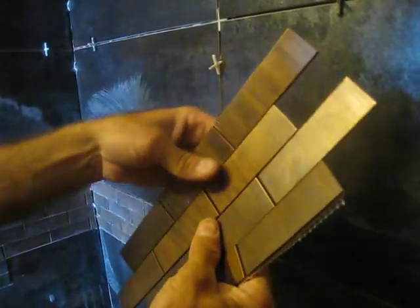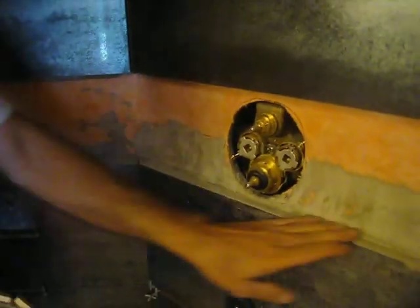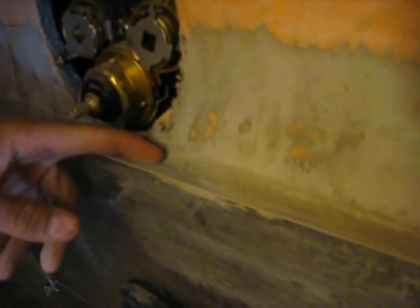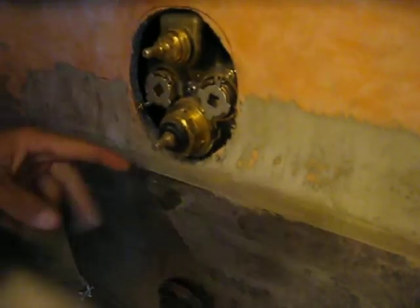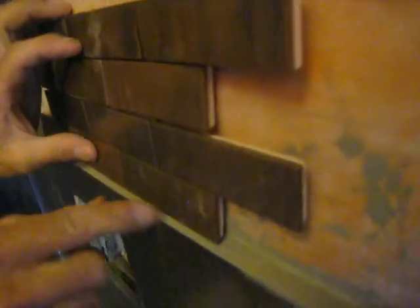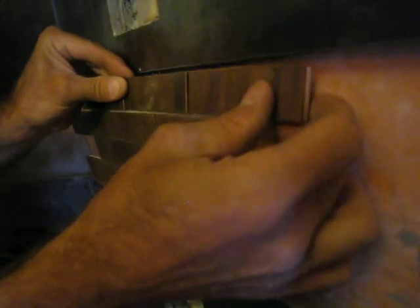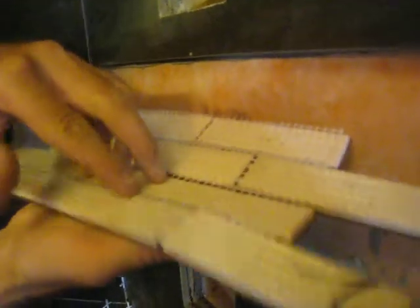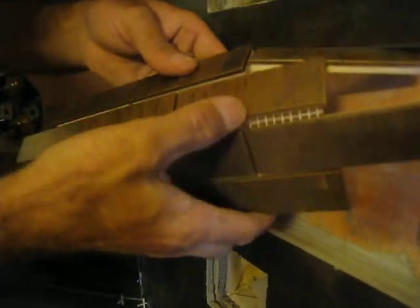So what happened is, if you look right here, I've got a lot of mortar, which is like normal. But when you're putting something like this on here — you can see the difference in the height here — when you put a lot of mortar sticking out and you're pushing it in, it becomes like a wave. Everything wants to fall, everything wants to shrink, and all the mortar goes through these holes and starts coming in.